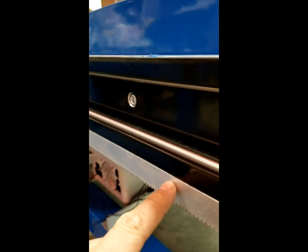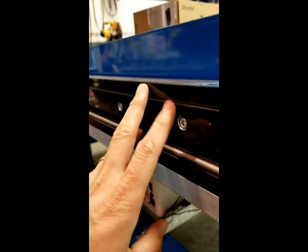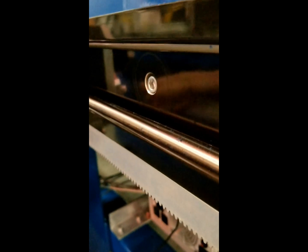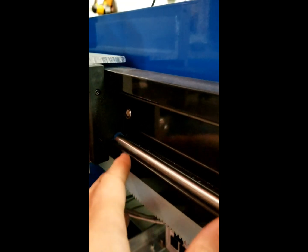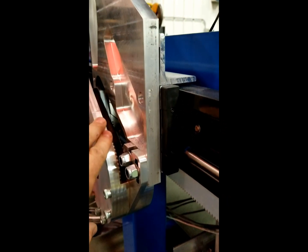Now let's move over to one of these machines where the pitch line of the gear rack is held to the bottom of the linear rail. What this does is guarantee that this is perfectly planar with the linear rail. This is a special linear rail made in South Korea, and it has spring-loaded oil-filled wipers on it that wipe the rail and keep it clean. We're using a rigid mount motor system to integrate the pinion into the gear rack, so the gear rack being held to this must have a perfect pitch line — that's really important to use this style of motor reduction system without any loss of positional accuracy.